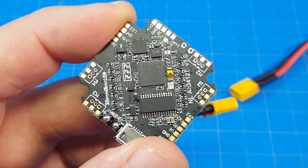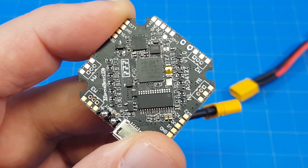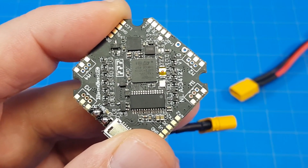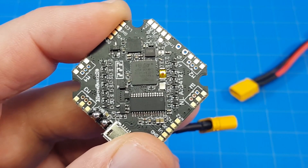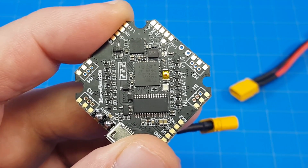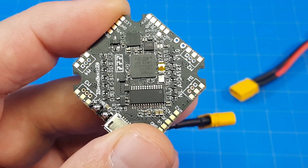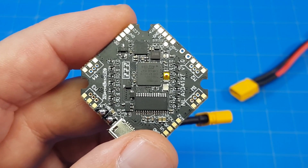Pretty clean board. Difficult to read, but as you can expect, we've got a lot of components on here. Some of the highlights: it's got an F411 processor in it, it's got a 2.5 amp BEC, which I think is a good thing. It's also got an LC filter, so hopefully that will give us a little cleaner video when it comes to any sort of interference we might get from motor backflow off the power.